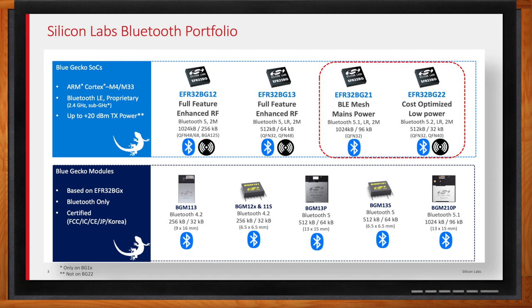The Series 2 devices — the 2.1 and the 2.2 — are a bit more surgical on their applications. The BG21 is our BLE mesh mains-powered chip — with those two together, that screams light bulbs. This is all about BLE mesh light bulbs; you don't need to focus on low power as much with mains power. The BG22 is a bit more cost-optimized and low power for asset tags, tracking, beaconing, and things like that — even blood glucose meters would be a great use case for this cost-optimized solution. Note: the BG22 has a proprietary logo but only supports 2.4 GHz proprietary, not sub-gig.